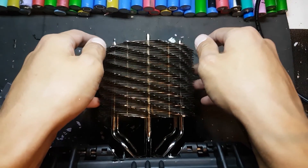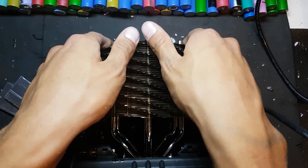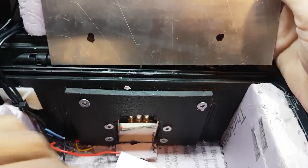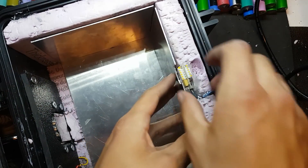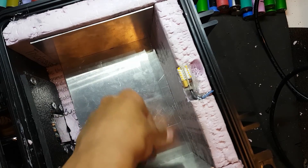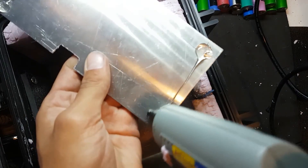After the wiring was completed, it was time to make the rear cooling assembly. This is where I made my major mistake. Peltier modules are only able to achieve such a large temperature difference whilst being effective — do not undersize your heat sink. I recommend a beefy air cooler for a computer. The CPU cooler was installed on a rear plastic plate and then screwed into the box. Another important part of the fridge is how the cooling is distributed inside. Originally I intended to use a fan; however, fans add a small amount of heat and add potential for failures. For a small fridge like this, I recommend aluminum lining. Aluminum lining will protect your foam from physical damage, and aluminum being quite conductive of heat will move heat to the cooling module effectively.